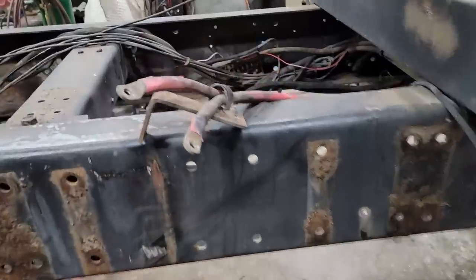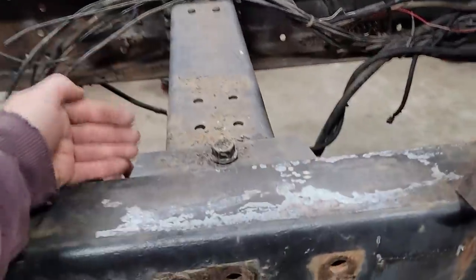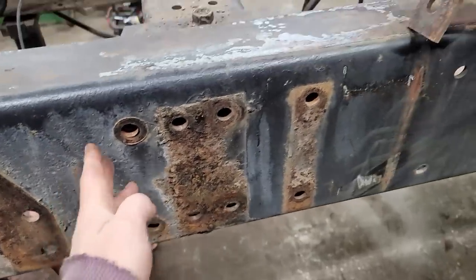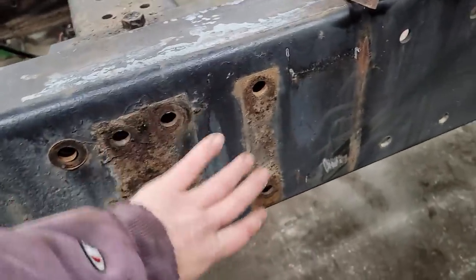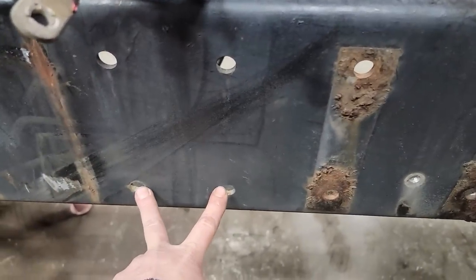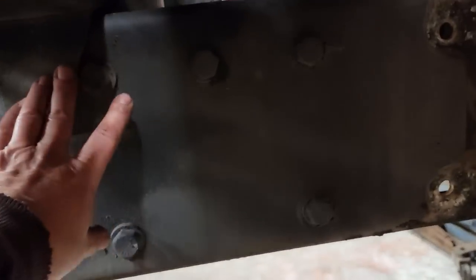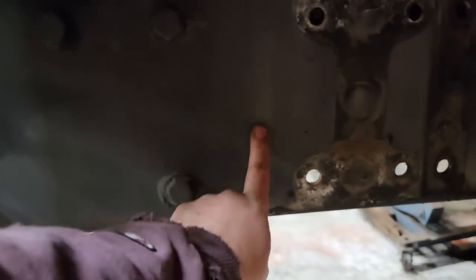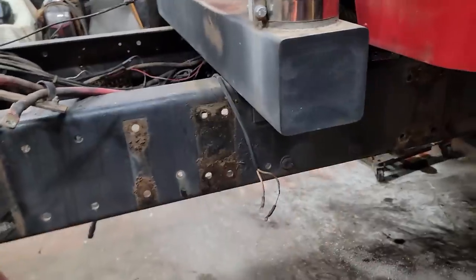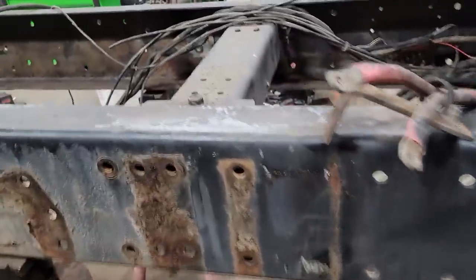That's all. So I thought if we spliced it here, we'll have a liner made for the inside. That liner, we'd bring it out to this area here, let it catch all these bolt holes because we need to use all those for what goes on the truck. We can catch two on either side of the splice here. We need those. And then we have another cross member right here, so we can bring our liner into this area. We can come into here. These are fuel tanks. So run that liner in there to back up our weld,